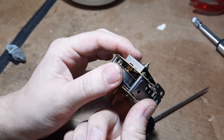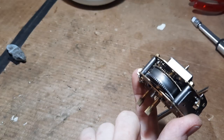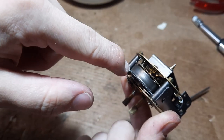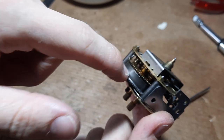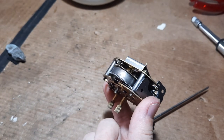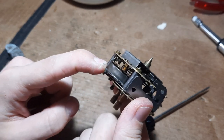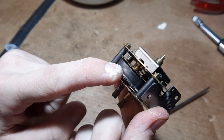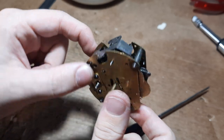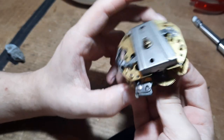Most of the time you should let the power down. Now if you're working on a Big Ben, you may find that there is a coil spring wrapped around this barrel - you can let down the power out of those ones by pressing on the end of the coil spring, pressing it into itself, which will sort of ease up the spring and allow you to disengage it. However with these ones you can't really do that because the ratchet is buried right in there and it's not one you can really tinker with, unfortunately.